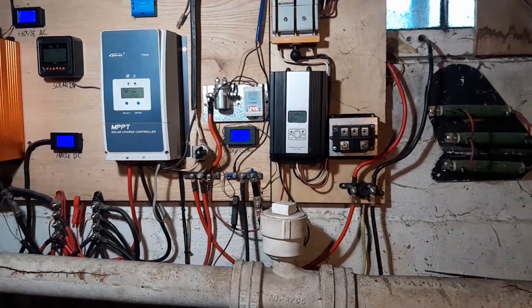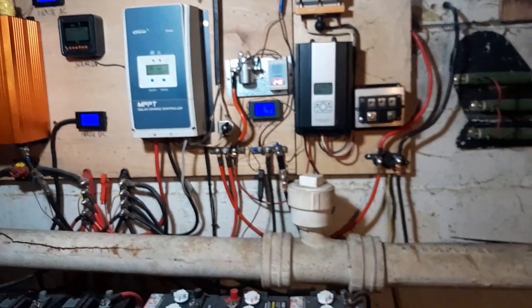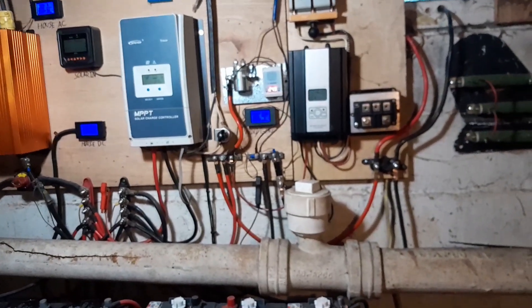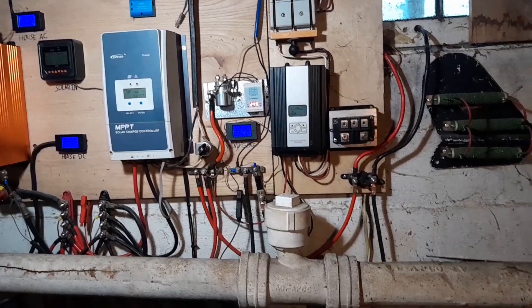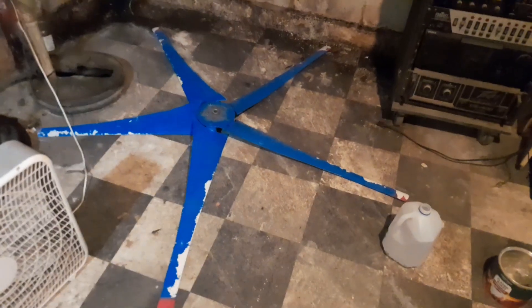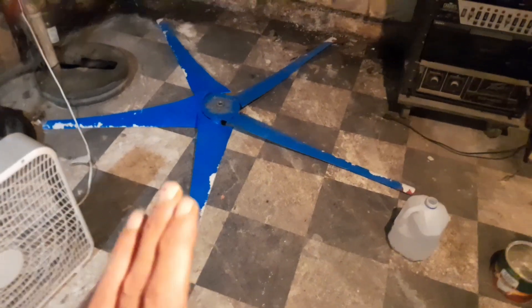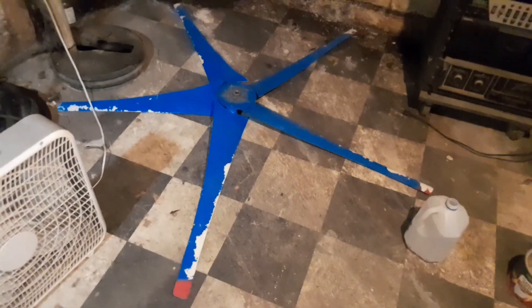Be sure pressure is on both sides of that rudder so it just stays and keeps her pointed into the wind. With the design that's on there, that doesn't do it. It's a little more stable than the five-blade. The five-blade achieved the RPMs we needed for power, but it would wind-wall too much. So that's the plan. I gotta get my holes drilled, get two blades off this setup, get her balanced, repainted.